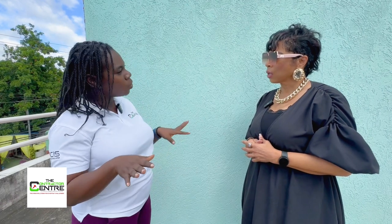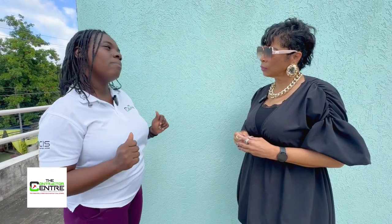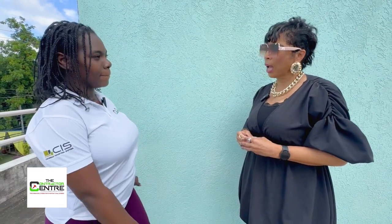And the white one gallon is six thousand five hundred. What's the coverage? The coverage is about 700 square feet per gallon, but we recommend you do about 500 square feet — that way you get as much coverage as you can. And of course we recommend two coats. If it's just sweating a little you don't necessarily have to do two coats, but we do recommend them.